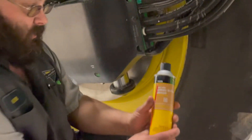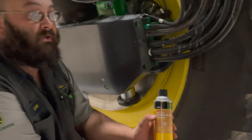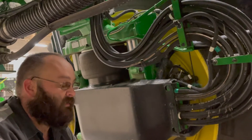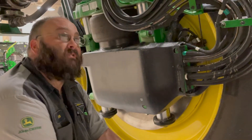On your tread adjust while you have it out, we recommend spraying it with this synthetic dry lube — it will make the tread slide easier on the tread adjust shims. Even if you do not move your tread, it is recommended that you still tighten up your tread adjust. As you drive through the field, the axle rocks and it wears on those shims, which can cause damage and break the bottom of the axle out.